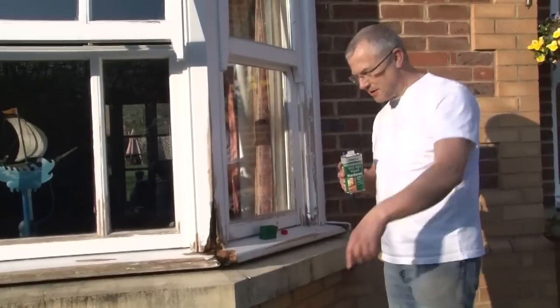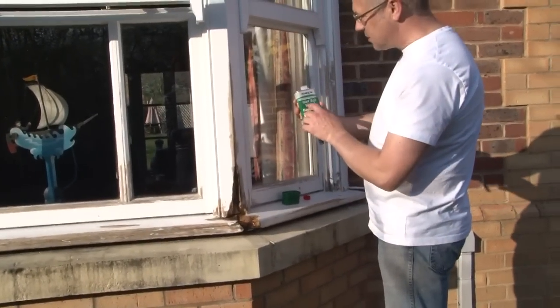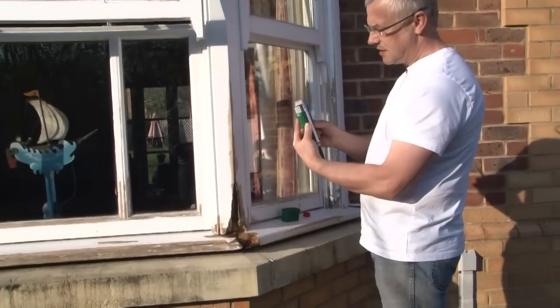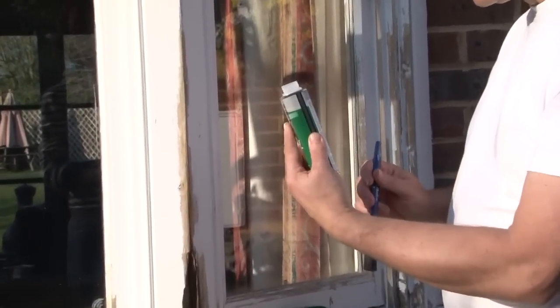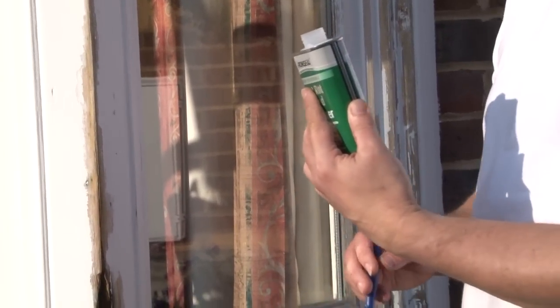Yeah. 1-2 hours later, come back lovely and dry now, sun's just setting. Got this wet rot hardener. Said earlier that it takes 10 to 20 minutes. I was wrong, it says on the tin 2 hours. So once this is on, that's it for today. We'll do another shot tomorrow with the filling, which is the exciting bit, I reckon.